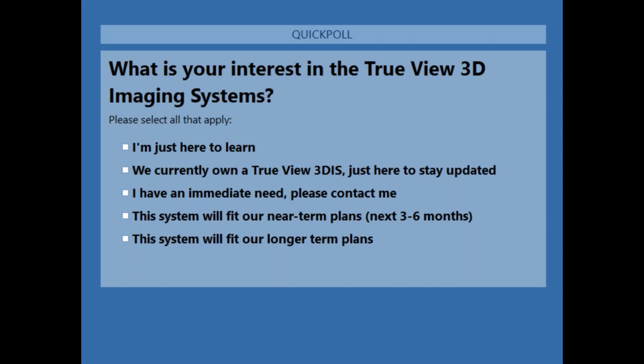The other area that does expand on that training a little bit, and I will just mention it because it comes up with almost all discussions we have with people: from the TrueView data, you're getting the point cloud, the obliques, the ortho imagery if you're running it through Metashape. Obviously, there's additional value add work that may need to be done to that. A very typical thing might be to do a digital terrain model or generate some contours off that data set. So there may be some additional training if you're not familiar with those workflows and those processes with LiDAR data that you may want to add on there.